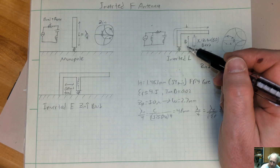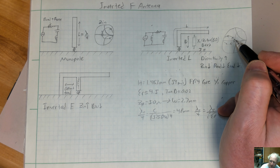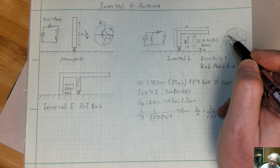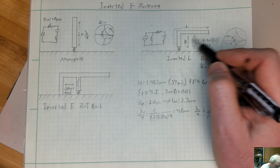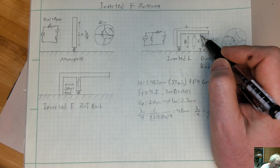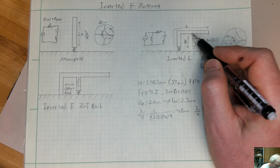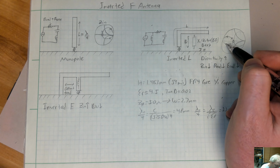And when you do that, you have the resonance right here. It is eventually going to come down and get to a short circuit. If you decrease this distance, you're going to come down and hit a short circuit. Equivalently, you're also adding shunt capacitance from the pole right here down to ground, and that's going to increase, so you can follow this way.